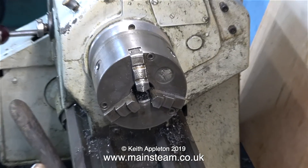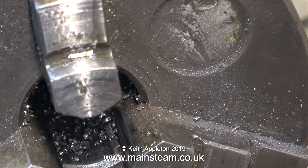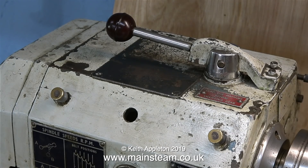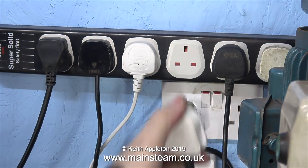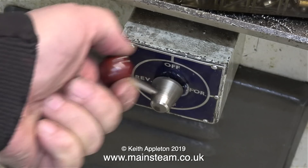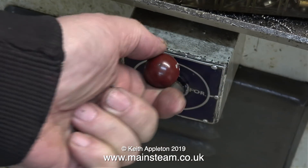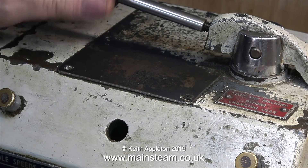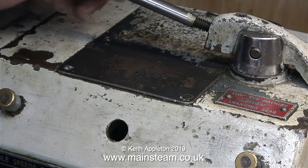This viewing angle isn't perfect but it will allow me to show with great clarity what I'm doing. Now it's time to get on with some essential maintenance, and the first thing I'm going to do is unplug the lathe from the mains. And just to check that I've unplugged the correct plug, I'm rotating the reversing switch on the front of the lathe. Here I'm unscrewing the lever that operates the back gear because I need clear access into the headstock.